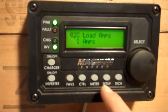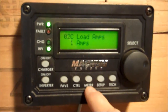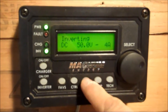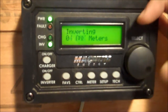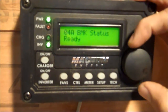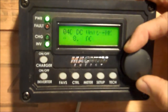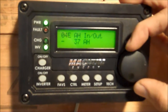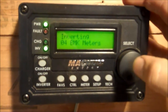There's one more thing I'd like to see every day: what our battery looks like in amp hours in and amp hours out — pretty much our bank account. Press Meter to get back to the main menu, then Meter again. That information would be found again in the battery monitoring kit meter, the BMK meter. Select. There's our state of charge we put in F1, there's our voltage right now, that's how many DC amps being drawn off the battery. And there it is — we're 37 amp hours in the hole.